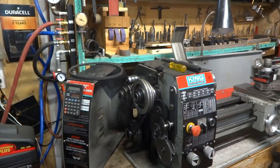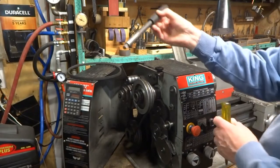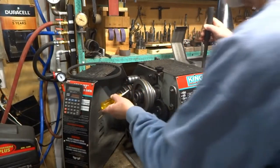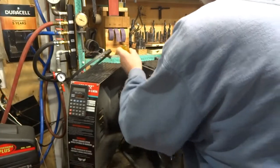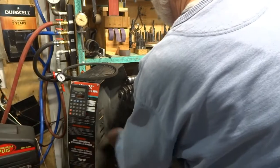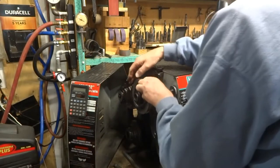It's a really good idea to slow things down before you start the threading process — you want to give yourself some reaction time in case things go wrong. I have a little tool I made for my chuck so I can move things around and make it easier to get the belts on and off. Take that belt off and put the smaller belt on the top pulleys.